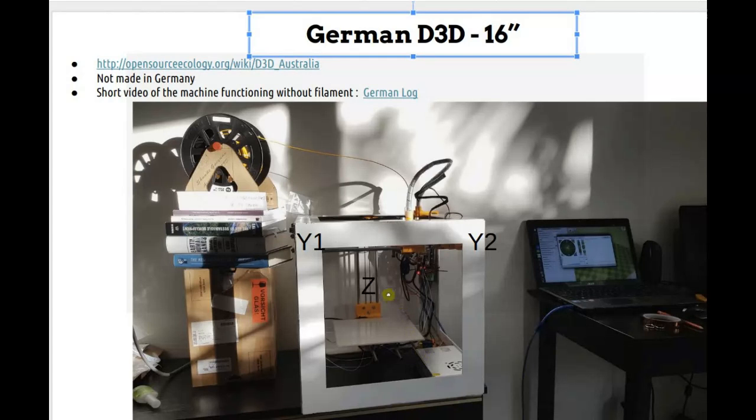I haven't really printed anything yet, because what I am more worried about is the jittering or going up and down of the bed as Z moves. Right. But it looks pretty stable at the moment. What I was thinking for now is to grab two small clamps and clamp the back of that short idler piece just to keep it closed. That will leave the bed a couple of millimeters higher on the front side, as I press on those two corners of the support. I see what you're saying. Yeah. And that problem is also eliminated when you have a two-sided support as well.